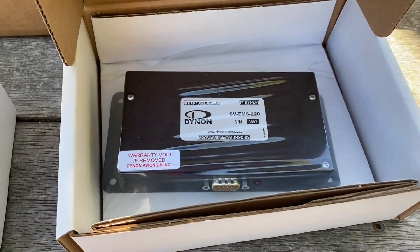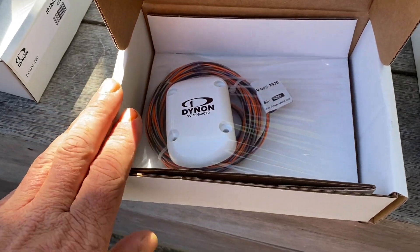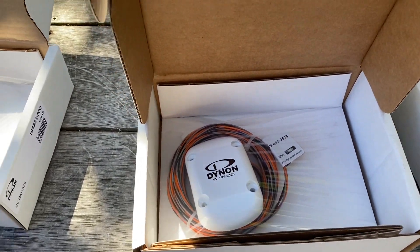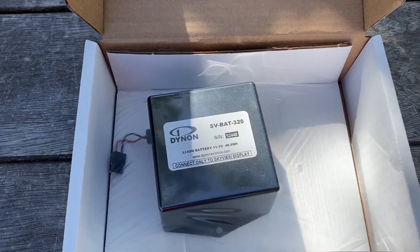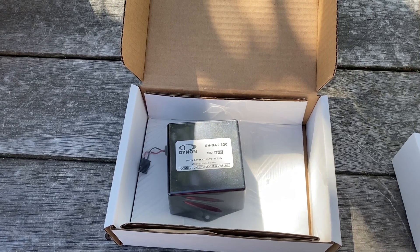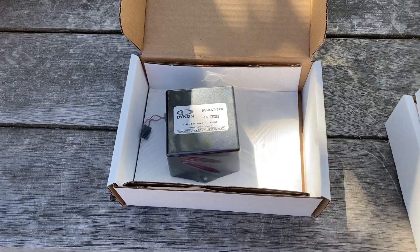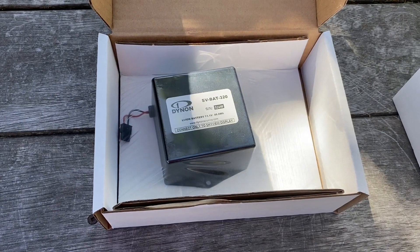That's the engine management system — again, quite small. This is the GPS aerial with GPS actually built into the aerial, and I've got quite a long harness made up to run from it down to the avionics rack. The backup battery — I was in two minds about it but in the end decided to get one. Two functions: during startup it keeps your displays running while the engine is being cranked, and obviously as a backup should the main battery fail. I've got two of them.